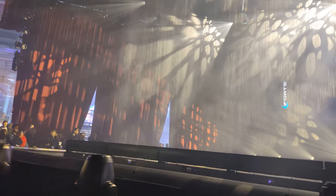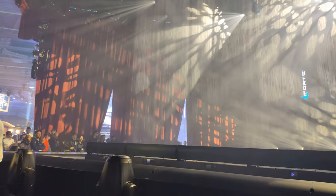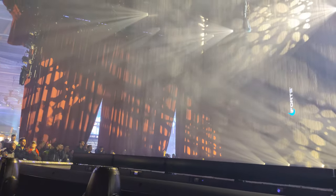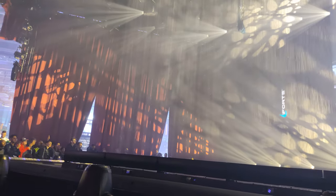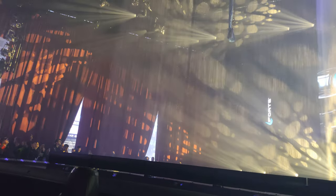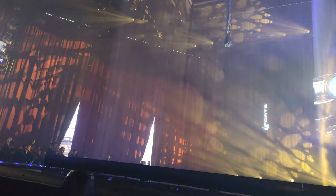Breakup and aerial gobos, prisms, a four-blade shutter system, and an animation wheel all combine to enhance and enrich the visual construction, and eloquently disappear into darkness with the smoothest of fades to black.